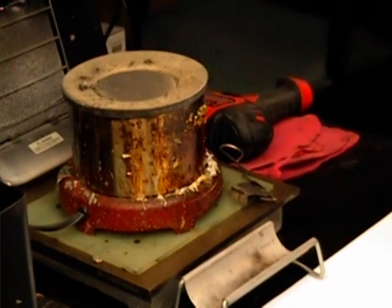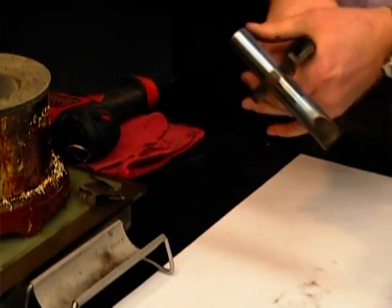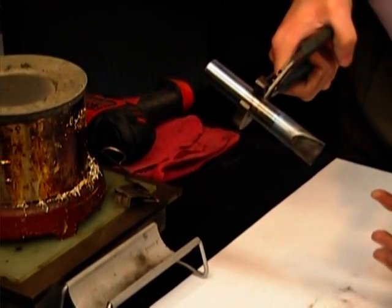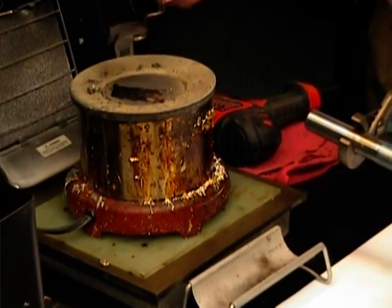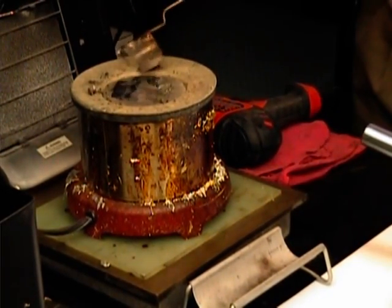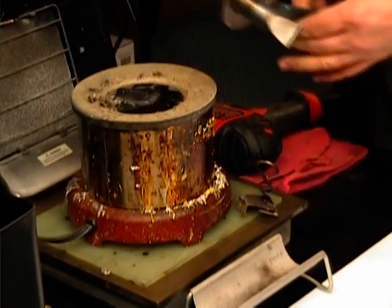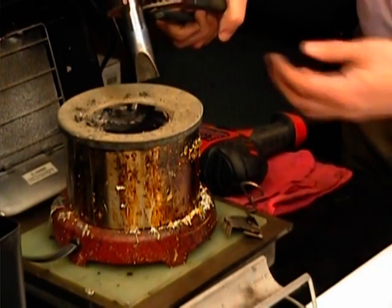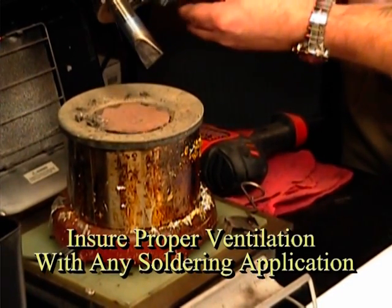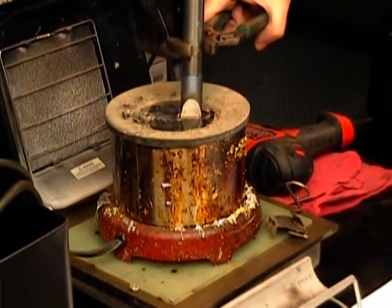The way I'm going to do that is I'm going to use a solder pot. You can wrap your rosin core solder wire around the tip and bring it up to heat gradually, but I find that a little cumbersome because as the solder starts to reach melt temperature, it falls off the tip and doesn't really wet it properly. So I prefer using a solder pot. One thing you have to remember is that solder is actually going to molecularly bond to the surface of the tip, so you can't just plunge it in — you have to allow the temperature of the solder to raise the temperature of the surface of the tip for proper wetting. I'm going to introduce it in here and turn my fan on to pull some of the smoke you're going to see from the flux.